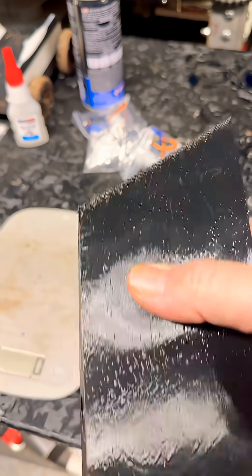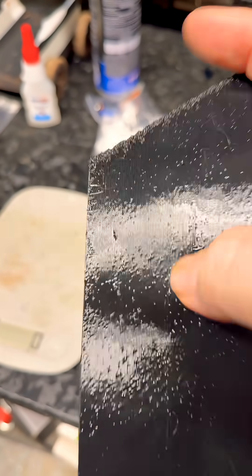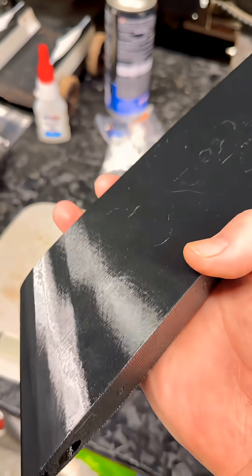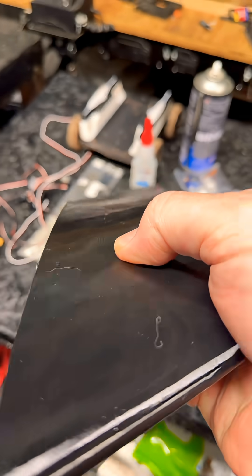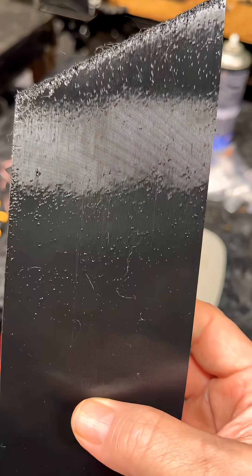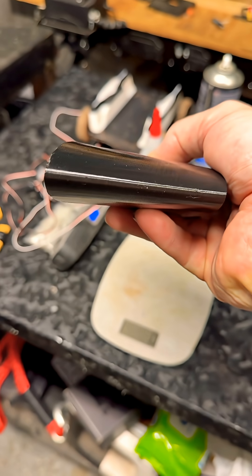The only problem with the 0.8 is the seam — you get seam pitting here. So you either have to do some seam painting where you put it on the end or somewhere where it's not going to be seen, in order to use this on any smooth surface. It's smooth, it's not really going to affect anything, it just kind of looks weird because of where the seams are starting and ending.